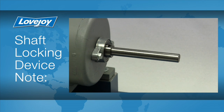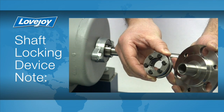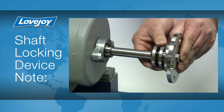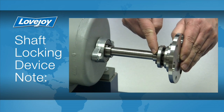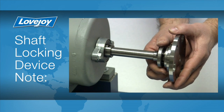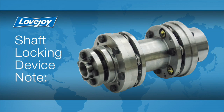When installing a disc coupling where one or both hubs are to be secured on the shaft using an SLD or shaft locking device, locate the SLD on the recess machined into the exterior surface of the hub. Then slide the hub on the shaft to the desired location and tighten the SLD bolts using the procedures and tightening torque specified in the SLD installation guide. The SLD is a keyless alternative to a clamping style hub and allows for axial and rotational adjustments to be made after the coupling has been installed. When the SLD bolts are loosened, the coupling hub can be removed easily without deformation or damage to the hubs, shaft, or shaft locking device. Whether the hubs are installed using the heat method for an interference fit or with a keyless shaft locking device, it won't affect how we perform the rest of the installation.